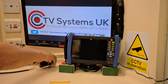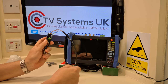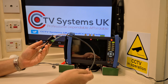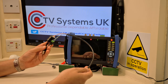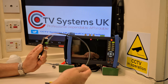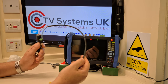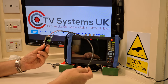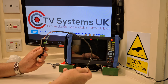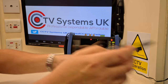So let's talk about why we need these. If you've already got Cat5 in your property and want to run it to an analog HD camera, you'd have to use these baluns. If you don't already have cable in place, you'd do away with this and get a HikVision POC — Power Over Coax — system instead. It'll do 200 metres just like this does. The reason we have baluns at all is that analog HD cameras couldn't work much more than 50 or 60 metres due to power problems. With POC, power over coax, you don't need baluns on a new install.